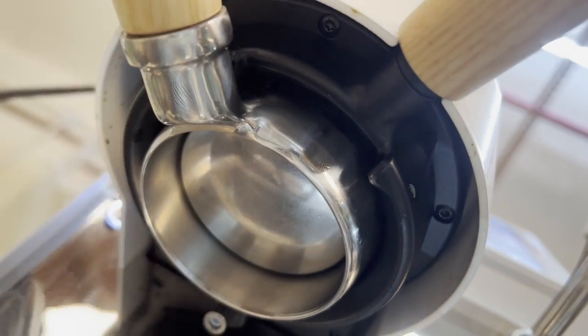Other gaskets may not have the word 'up,' so you generally have to look at the gasket itself. Normally the gasket will have a little chamfer on the inside. If you are installing it and there's too much resistance, you've generally put it in the wrong way — it should just slip in quite nicely and easily. If you're having a little bit of trouble, just double check you've got it the right way round.